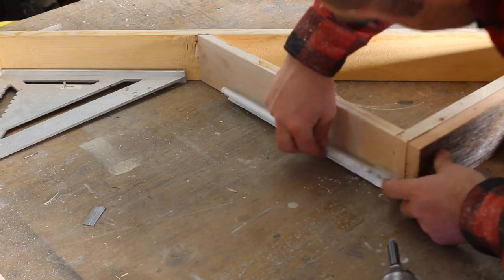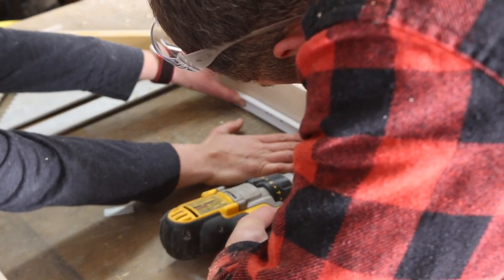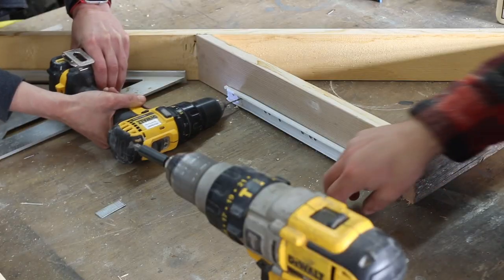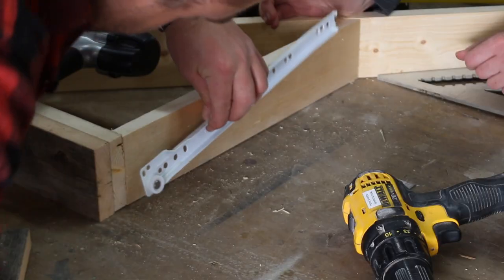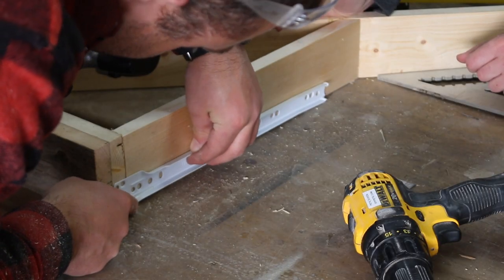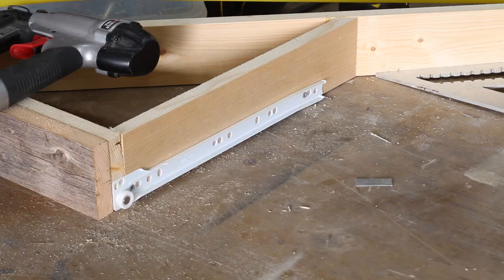I used 14 inch drawer slides for this project, and they were really easy to install. The right slide should be mounted with the wheel toward the front and in 1/16th of an inch from the front faceboard. I then rested the hardware flush with the bottom of the frame and attached it with the short screws included with the hardware. Do this on both sides of the frame and drill pilot holes to help get those screws lined up perfectly.